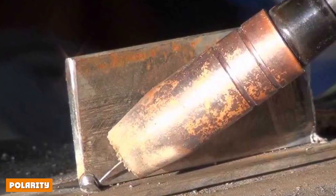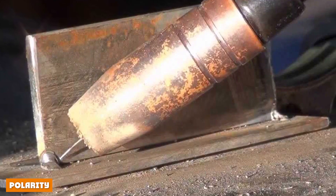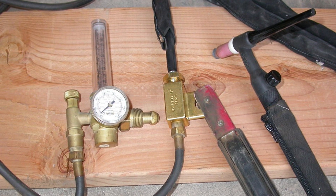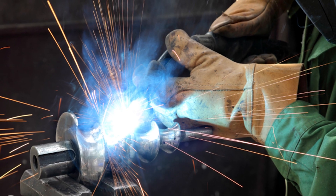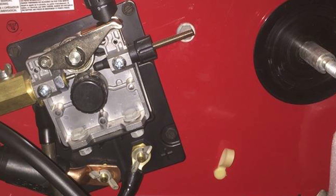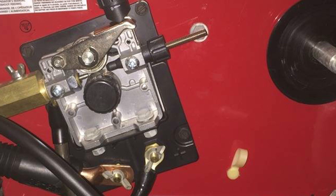The filler material for MIG is pure compared to flux core welding. Multiple welding passes require strong metal, and MIG is perfect for multiple passes. The wire alloy often matches the welded metal. There are impurities added to flux core wire and most wires are designed to work with specific metals. Some wires consist of manganese which makes them unfit for multiple passes. Always choose a rated wire for multiple passes to avoid poor-quality welds.